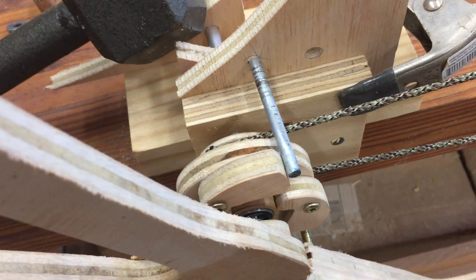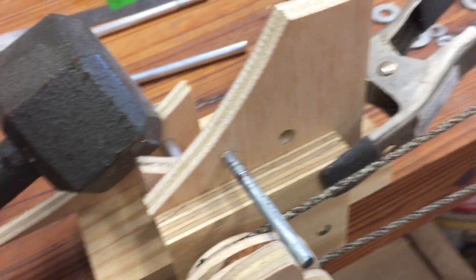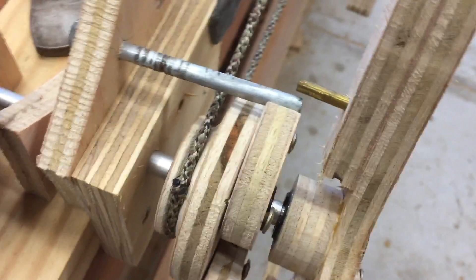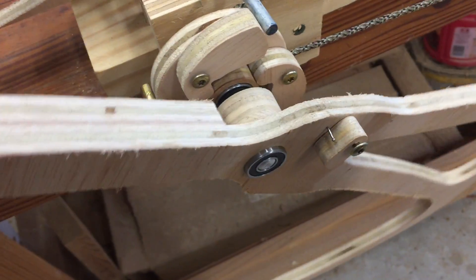You can see it has stopped there. Another pin here, attached to the wheel, comes by and pushes that one out of the way, comes over and runs over the top of this one. If it's still raised up, it pushes it down just a little, and then it clears that pin — just so that the pawl still holds it, but it allows the brass pin to pass.